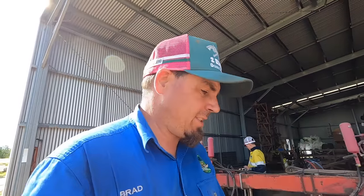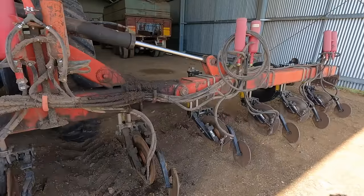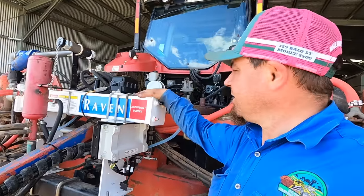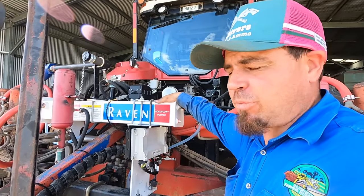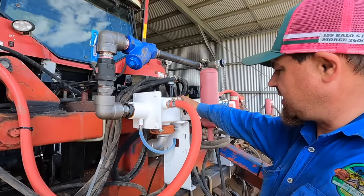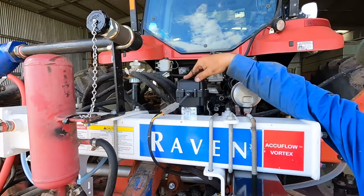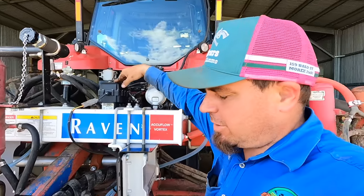It's towards the end of the day now. We've had a little project for the last few days - Matt hasn't been here to keep on me. We've got our gas rig where we do the NH3, and we've just put an auto setup on it. This big white box is a cooler - it keeps the liquid cool. When it's cool it stays as a liquid, when it warms up it turns into a vapor when released from pressure, running at about minus 30 degrees. Up here we've got our control valve, like on a sprayer - this one turns it on and off and regulates your flow. It's called a fast close valve.